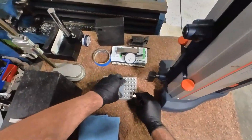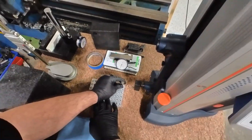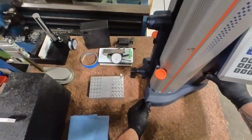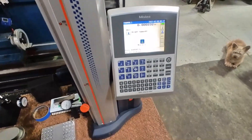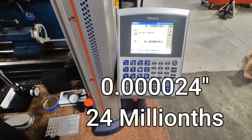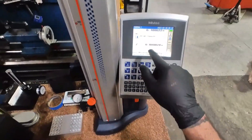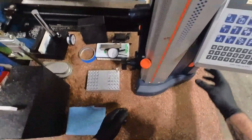Use this button for the air bearings. Move this out of the way — I don't want to move the part. Place the pin in the bore on the very end and measure again. Not even two tenths — that's a lot of zeros. Look at that: zero, zero, zero. Yeah, that's almost perfect. That's awesome.